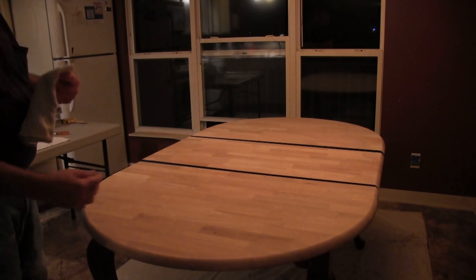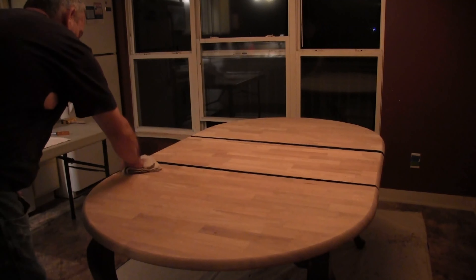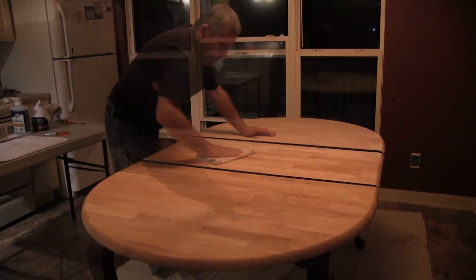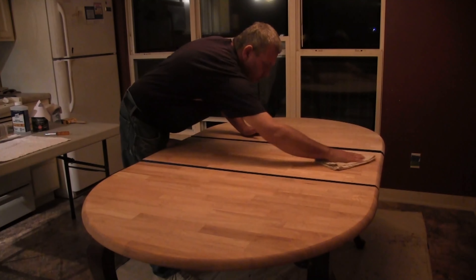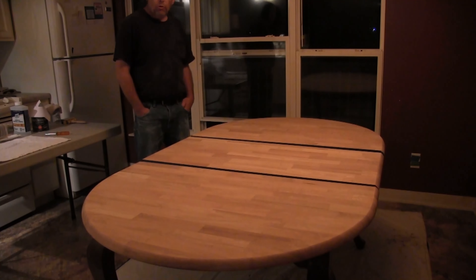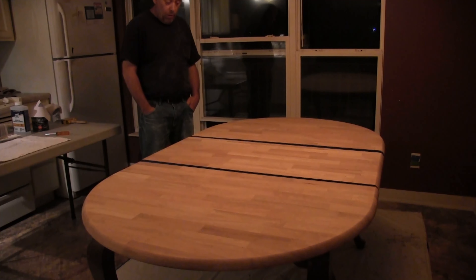Here is my wet towel — let's just see how we do here. It's not perfect; there are still a few rough spots on it. However, when I sand the next coat of poly, it should pretty well smooth out.